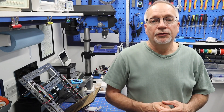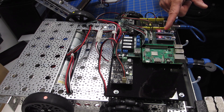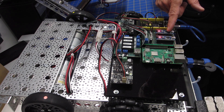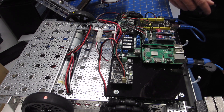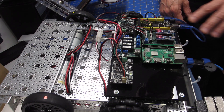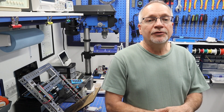There's still a lot of code to write, but I want to do a bit of a demo today. I've got DB1 here right now, powered on, with the two Arduino Nanos forming our motor controller. Each one is running demo code, so if I press the reset button on one of the Nanos and wait a couple of seconds, the wheel starts moving forward at speed 200, then reverse at 200, then slowly accelerates up to 255, stays there for a few seconds, decelerates, and then does the opposite direction with acceleration and deceleration.